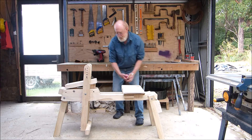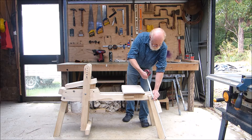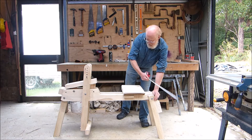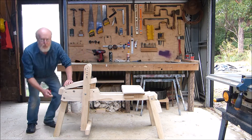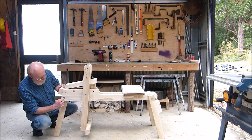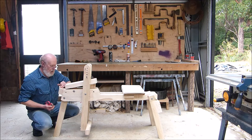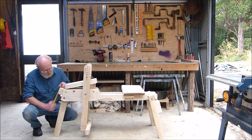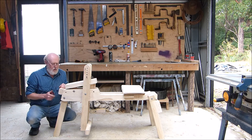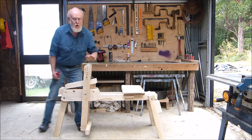The actual legs — I followed the Country Workshop length, which is about 550mm or 22 inches. The front one, because it mounts from a different swivel point — the lower point — and it's coming higher here for the stop, needs to be a little bit longer. It was 24 inches or 600mm in length on that one.